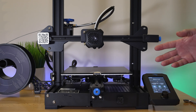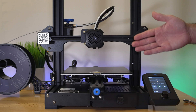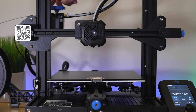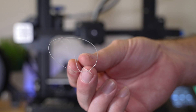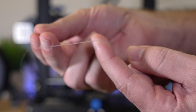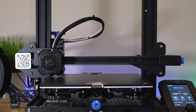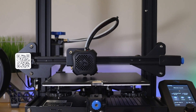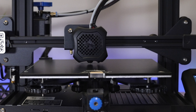Let's go ahead and go to print and choose the 0.2 benchy. I'll jump to the slicer in a second to show you exactly what to do to print with different nozzles — it's very simple. We're not changing anything except for the nozzle size compensation. We're still printing at 50mm/s, 200°C on temperature, 60°C on the bed — pretty standard settings. As the nozzle heats up I'll purge the filament — and the filament coming out is thin as hair. It's printing, looking good, and everything seems much finer with the smaller nozzle.